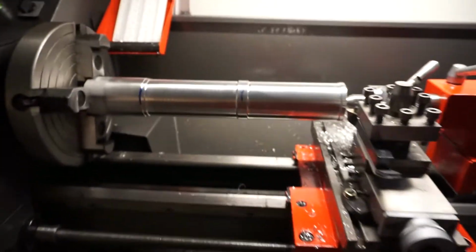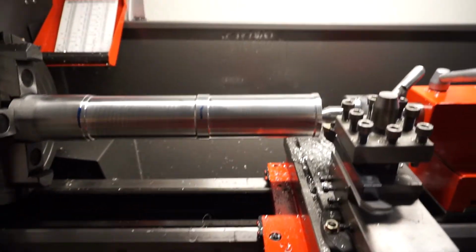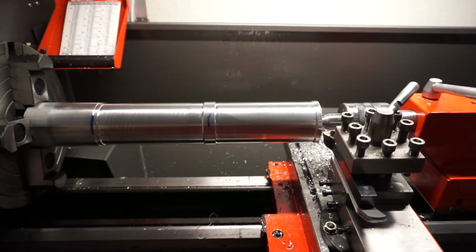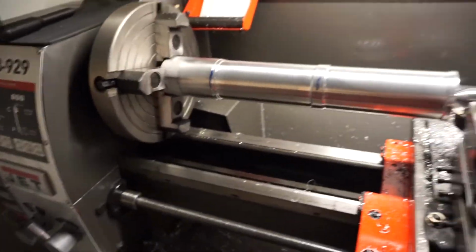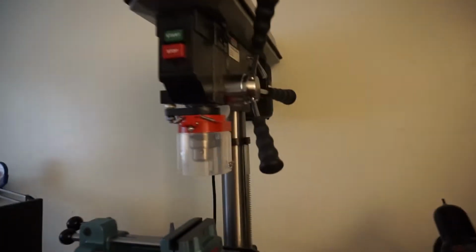Figured out that I needed some different carbide. I have a general purpose WNMG insert set up, and it's not made for aluminum. The rake on it, I think, is getting all bunched up because the stuff's rolling over into itself on the way out of the chip ejection. So that's all good. Also got the drill press up and good.